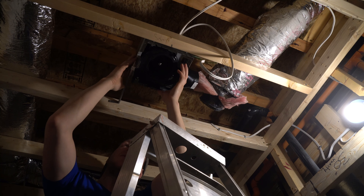For my purposes I'm doing 5/8ths. For yours, if you're not doing 5/8ths, flip all the half-inch tabs out. Now that we are at that area we know where we're at. When the drywaller puts the drywall in, it's going to bring it up. The last part — now that we have this all assembled, you have these machine screws which they give you as well, and these are for the sides. They actually sent me with the wrong screw packet — they gave me these machine screws, but even in their manual they say it should be a stinger-style screw that drills into sheet metal.